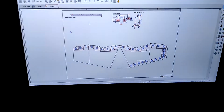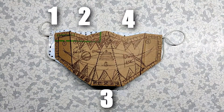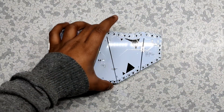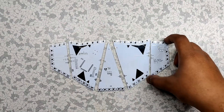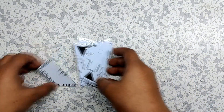I first prepared a cardboard mask with a template and then prepared the schematic for this project based on its shape. This project required 5 PCBs, and ordering 5 PCBs costs more than ordering a single huge PCB. So I prepared this PCB in such a way that a single huge PCB can be cut down into 5 different PCB shapes without affecting the connections of the whole board.